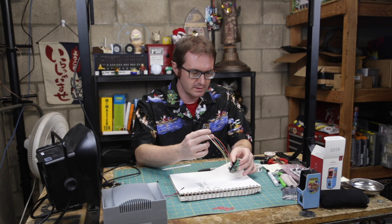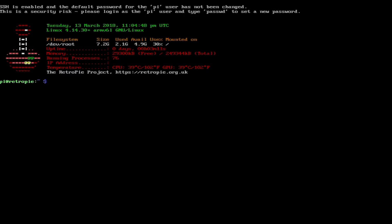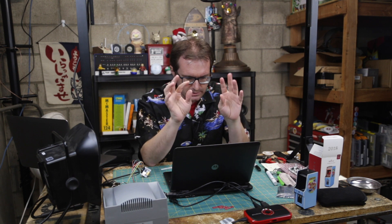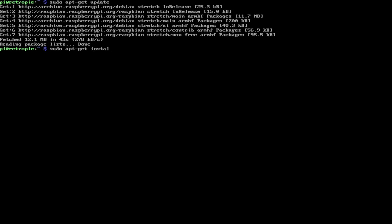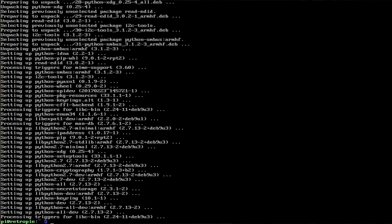Our screen is wired. Now let's plug this thing in and see if we get anything. So now we're back on the Pi in the command line interface. The easy way is to use a little script called nanoscreen, which is over on GitHub. In order to get that going we need: sudo apt-get install python-pip — this is a Python program — then python-smbus and python-spidev.